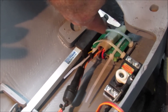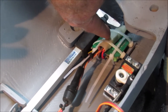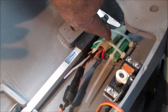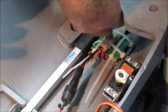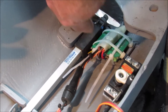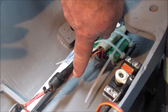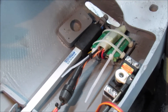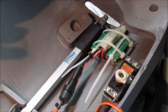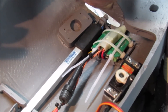This particular piece right here is a 12-volt boost regulator — it takes my regular battery voltage and boosts it up to 12 volts. This is a non-flight-critical activity, so I put this thing on a 1-amp fast-blow fuse. If it ever gets bound up, I don't need it drawing current and killing my battery. That's mounted all the way up there near the firewall.